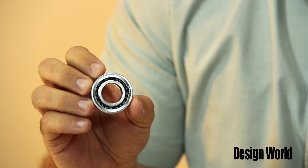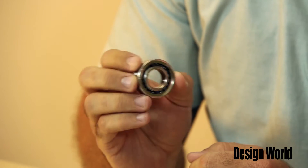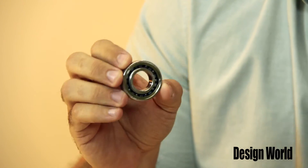In addition, the VDFO lasts more than 10 times longer than conventionally greased bearings. This ceramic hybrid bearing uses stainless steel rings, silicon nitride ceramic balls, and a fluororesin self-lubricating cage, making it suitable for corrosive environments from normal atmosphere up to vacuum. The key characteristic of this type of bearing is its durability in water-immersed environments. These hybrid bearings have an operating life more than five times as long as that of stainless steel bearings.